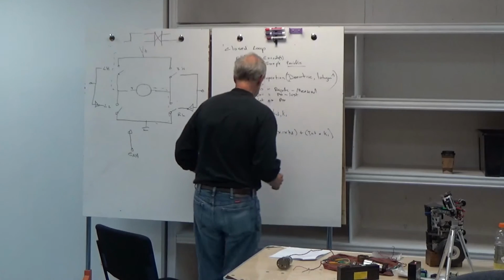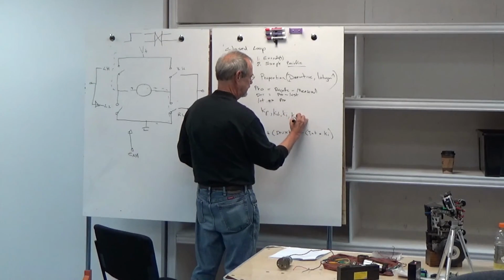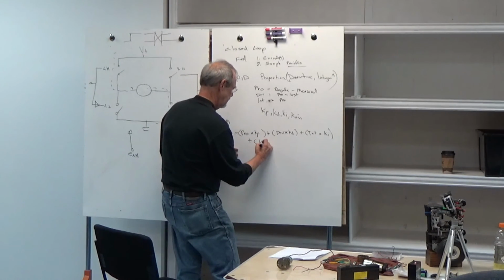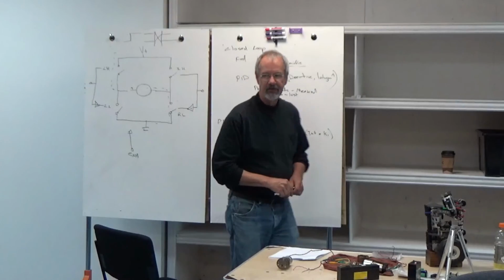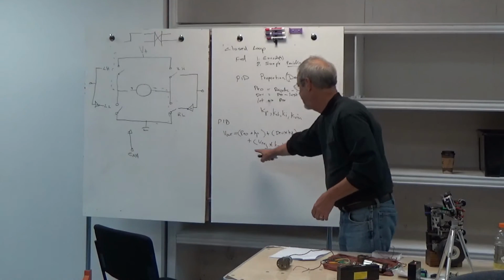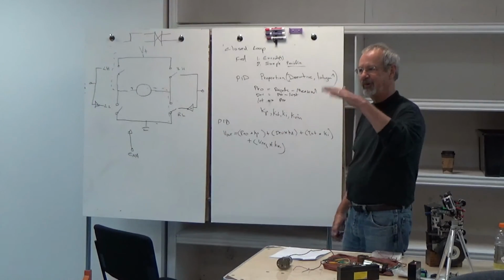So for the feed-forward term, we're going to add one more constant here. And we're going to say this is plus our requested value times its constant. What that does essentially is it gives you a cheat on getting to the set point. You get to the set point real quickly. This guy takes you right there, and then this guy adjusts you around the set point.